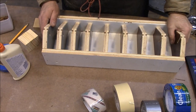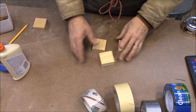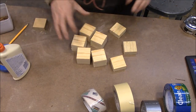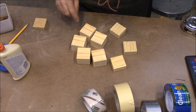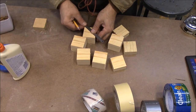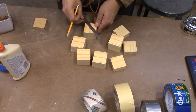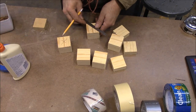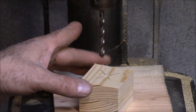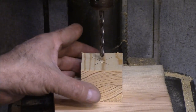It's all glued and nailed together — I'll set that aside to dry. Next, we need to mark these spindle blocks to drill the holes for the pin they'll ride on. I'm just going to mark the diagonal on each one to find center. I've got a quarter-inch drill bit in the chuck and made sure the table is squared up to the bit, so let's get these drilled.